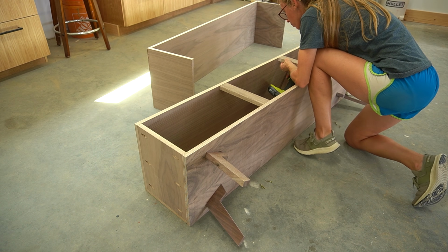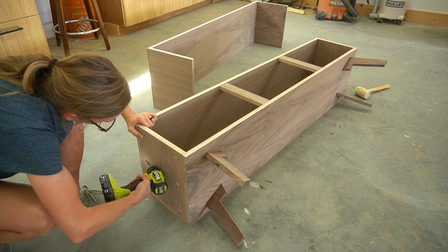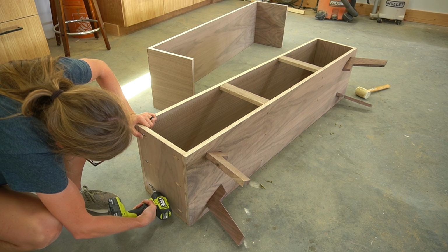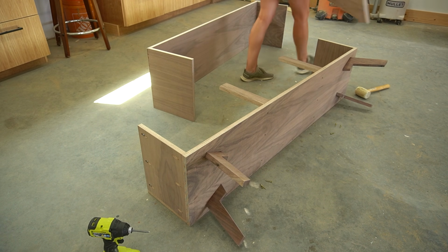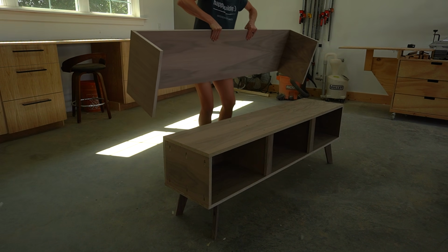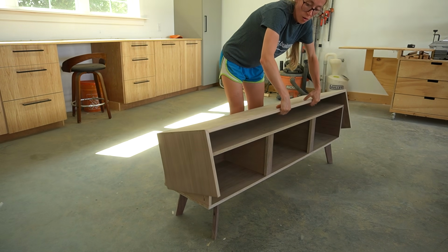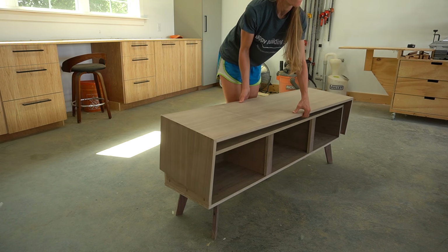This is why I recommend building the outside first, then building the inside to fit. It's much easier to modify the size of the inside box than the outside box. So I took it apart, trimmed the top, bottom, and back down 1/8 of an inch and reassembled it. Once it was back together, I tried this again. Thankfully, this time it fit and I could move on.